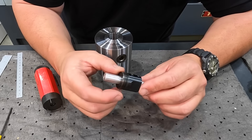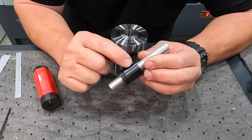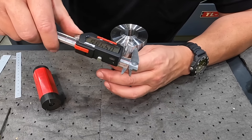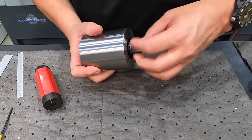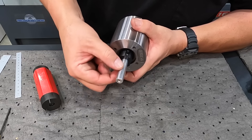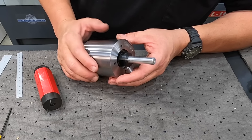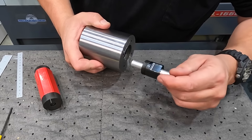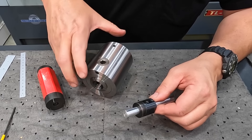I'm not sure who made this collet stop — it was another gift. It's very simple in design and you could make one yourself. It's threaded to fit the back of standard 5C collets. It has a couple of set screws with flats milled on it for tightening with a wrench, and an aluminum half-inch rod through the center with a flat that locks into the set screw. You screw it into the back of your collet, tighten it up, and adjust the stop rod wherever you need. That would be a great little shop project to make yourself.